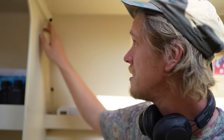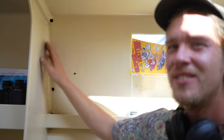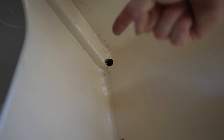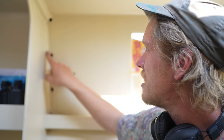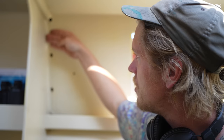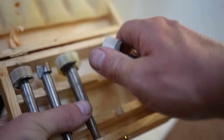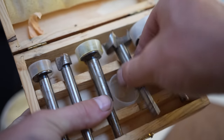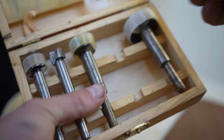This is one of the main bulkheads and there were holes drilled either side. Hanneke basically told me to oversize drill these holes just to check the plywood on the outside to see if it's okay. She said that the chain plates could be put here. I'm kind of tempted not to have them here with the holes so close to the bulkhead. I can't imagine getting a washer in there would be very good, especially up at this top one, unless I move the whole thing down. I have these ridiculous oversized drill bits, which were given to me by a subscriber called Yap. Thanks, Yap.